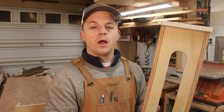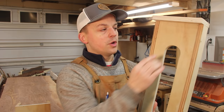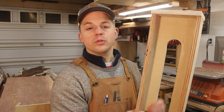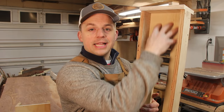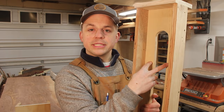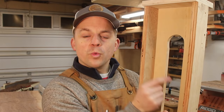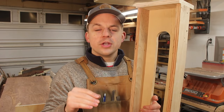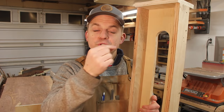On the router sled you have two indexing surfaces. One is the outside edge that rides along the rail of your router sled — that one needs to be perfectly flat and smooth. The other critical one is on the inside of your router sled. Your router is going inside and sliding back and forth on this surface, and whatever bumps or variations you have in this surface will all translate to your finished piece because this is an indexing surface. When you put this together with screws coming in from the side, that causes the plywood to expand slightly along the edge, and if you put a straight edge along it you'll probably see some variation.